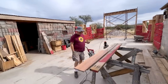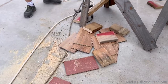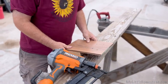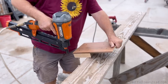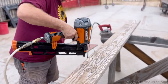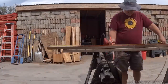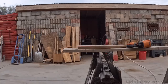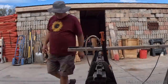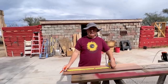What we're building: we're pulling together some cleats — special cleats because they have to hold the braces that go from the shop walls out to the truss beams that the roof holds on. These will set on top of the walls and be backing for a brace that goes out to the walls the roof sets on. The beams that stick out the sides of the shop all around it need a place to mount to the shop — they're more or less tying it in rather than receiving any weight.